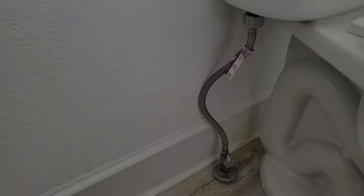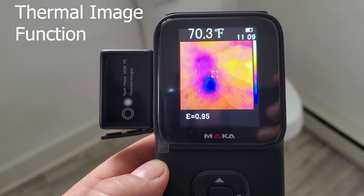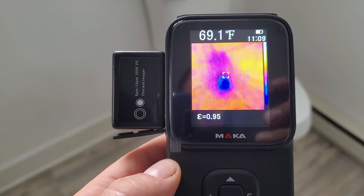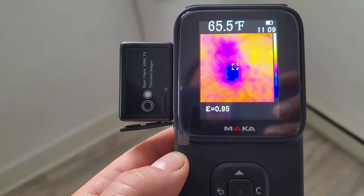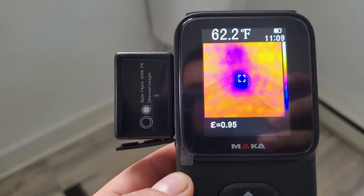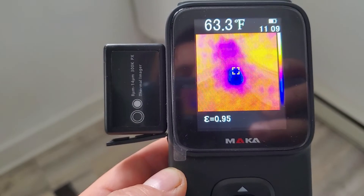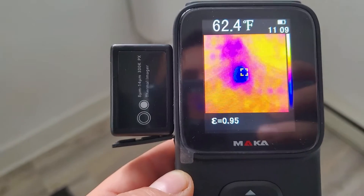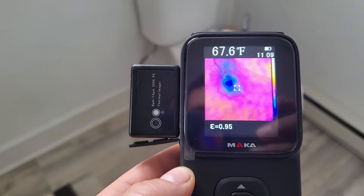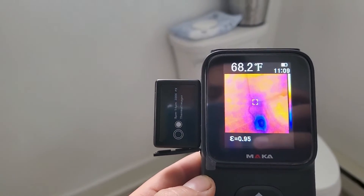The thermal camera is probably my favorite feature of this device. I sprayed a little water behind the toilet just to demo - when using the thermal camera for inspections, moisture behind the toilet shows as a nice cold spot, which is an indicator of water. So you'd know right away that you have a leak there. That's what it would look like.